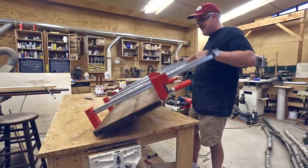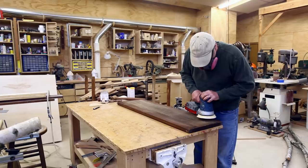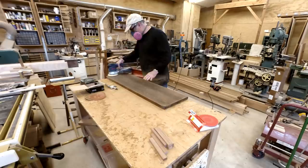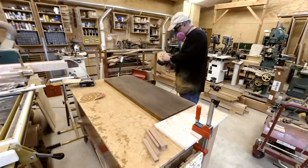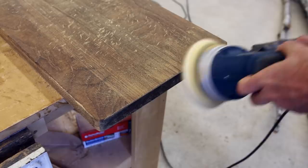I glued those up and they look good. I let them dry overnight. The other thing they wanted me to do was to sand the surface a little bit, just to take the edge off all of the knife cuts in the board. I didn't really sand down to a new surface, I just kind of took off the edge. These boards, being used for fish every night and being re-oiled every day, are completely impregnated with oil, so they clogged up the sanding discs really quickly.